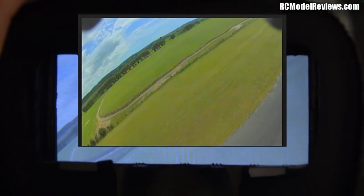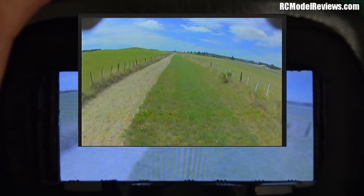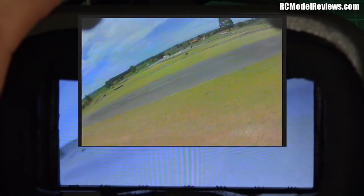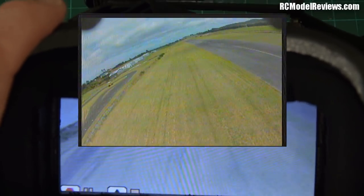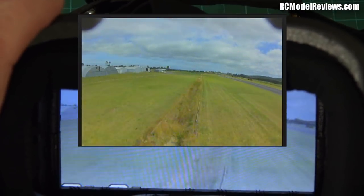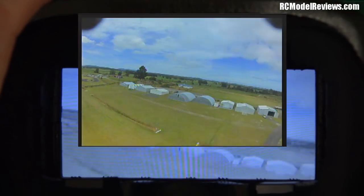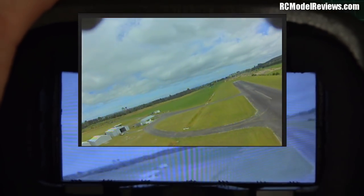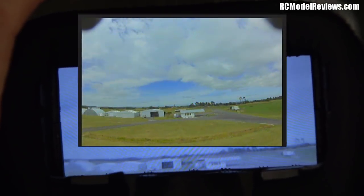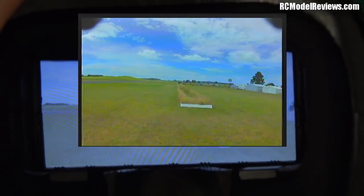Let me summarize what I've found with this visor. Positives: it works pretty much as advertised out of the box — 40 channels, diversity, comes with a couple of aerials that seem to work quite well. It's nice and light, fits on your face reasonably well, and you can customize the fit by adding a bit of foam. Comes with an XT30 power connector and is quite versatile in power source from 2S to 6S. The physical construction is quite nice. The resolution of the LCD is 800x480. It's 16x9 by default. For all specs, I'll put a link to the RC Timer website in the description.